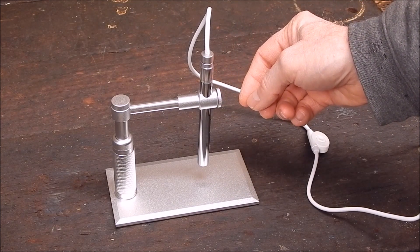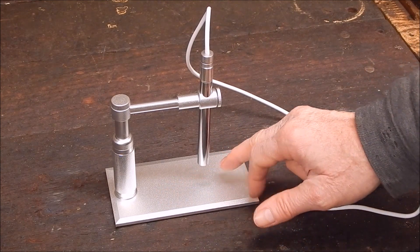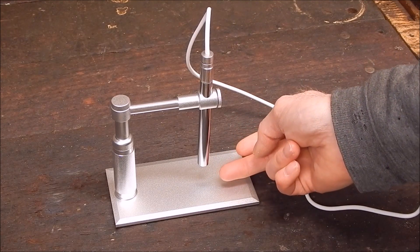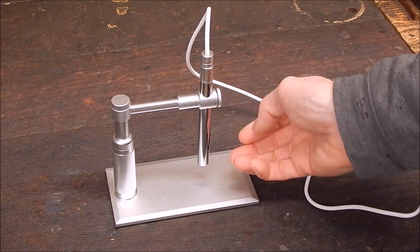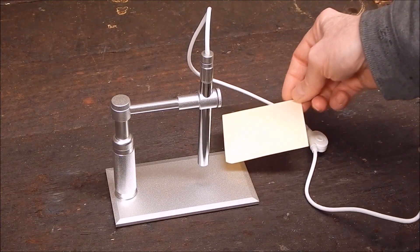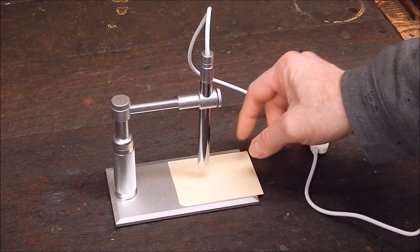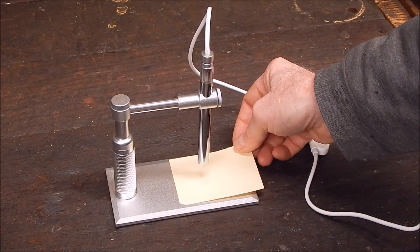It's certainly way ahead of the really cheap ones and the image quality is fantastic. You have to watch it with the base though — being aluminium it's highly reflective, so you can easily oversaturate the image if you've only got a very small item under there. A bigger item which covers the whole projection width isn't an issue, but something really small will cause problems with colour saturation and light adjustment. You can get around that by just using a bit of matte finish paper, cardboard, or a manila folder. Put your item on that and you can move it around without touching it — it'll stop all that reflectivity problem.